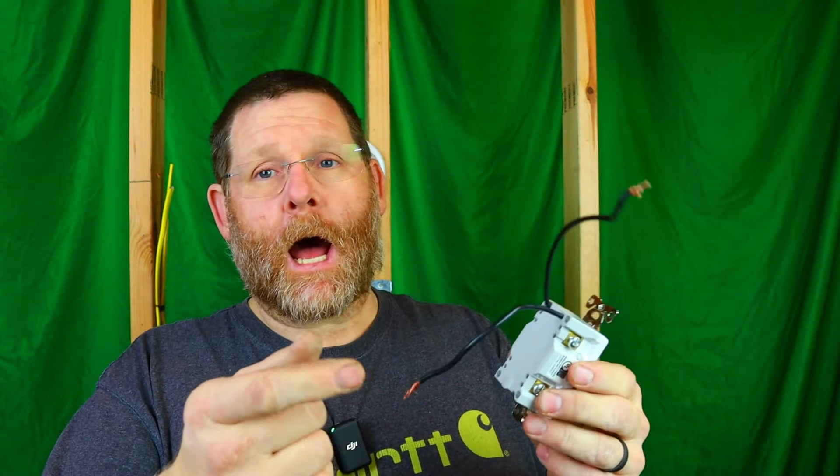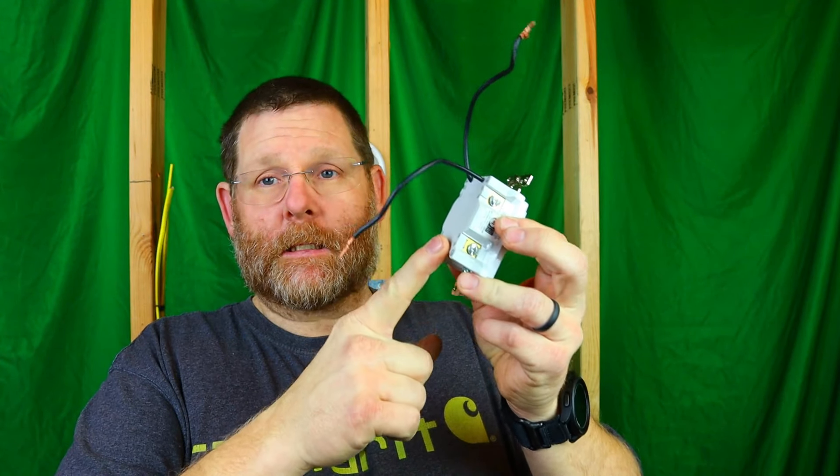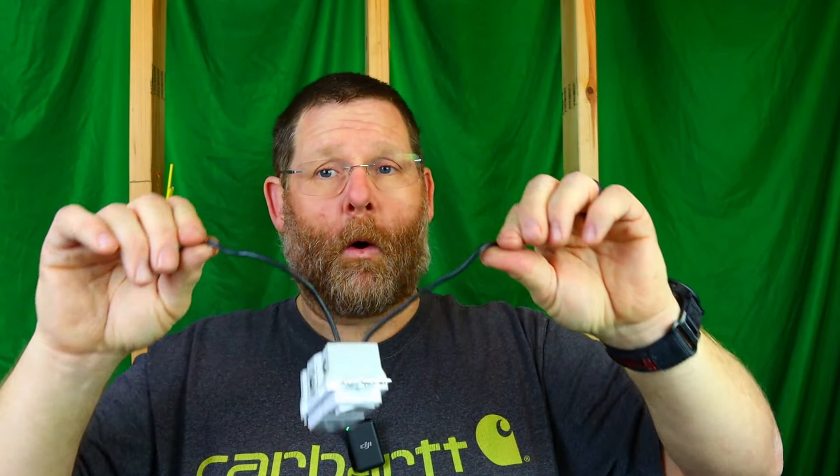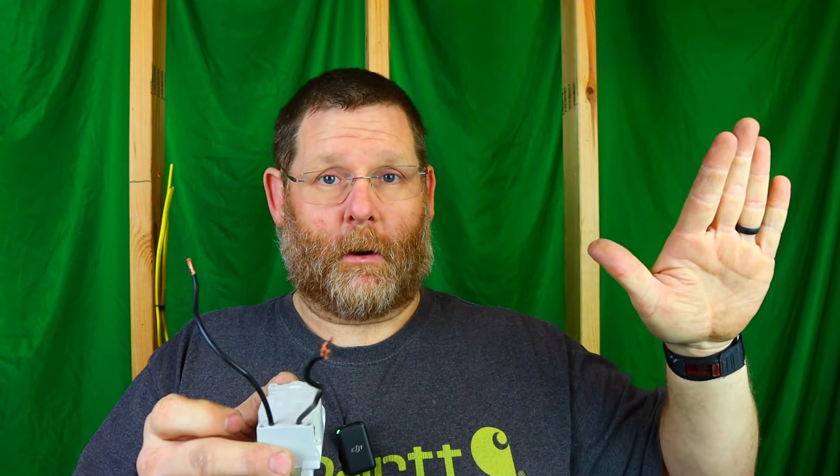One of the questions I had was: since there's a switch on the top, can I not just put this wire into the hot instead of making a bunch of joints in there and putting a whole lot of wire nuts in the box — kind of simplify it? So it does not matter on this switch which side you put into the hot. It says right on the back: switch output. It does not matter which side you put into the hot. So if you want to put this one on the hot and have this one for your switch leg, or vice versa, these do not matter.